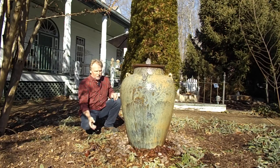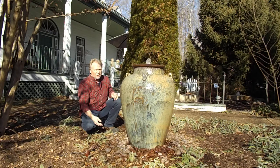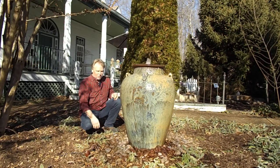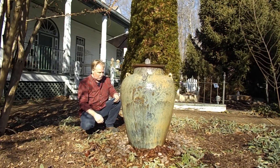If you've got a boulder or something like that, turn the fountain off and let it dry out. When it dries out, it will kill the algae. You can still use a soft bristle brush, but we find it easiest to just turn it off and let it dry out. Then take a leaf blower and blow the dry debris off.